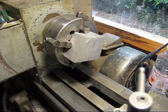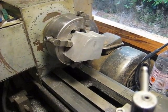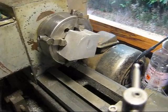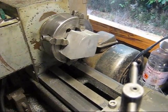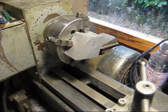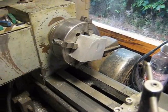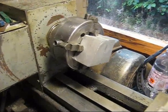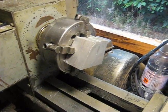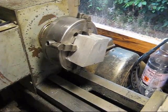So I finally managed to hack out a great big lump of aluminium from a piece I found at the metal recycling plant, and I've got it mounted in the four-jaw chuck. First thing I'm going to do is a pilot hole down the centre, then make a bigger hole and bore that out, and then I'll have to see whether I turn down the outside diameter on this side or turn it round and grip it from the hole I just bored. We'll see.